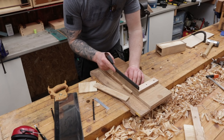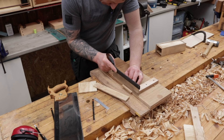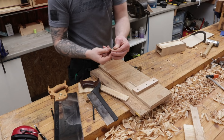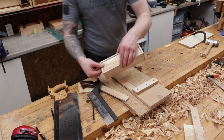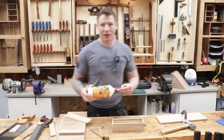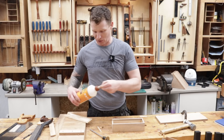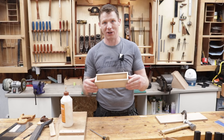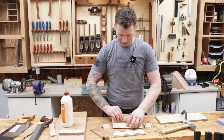We're going to cut the top of the box off using the edge of the rebate as a guide to get a nice clean straight cut. Then we take that piece and glue it onto our lid so it looks like the box is closed. The next job is to get the box all glued up. When that's set up we can fit the lid. We need to make sure we don't glue our base into the box — we want it free floating inside that rebate to allow for expansion. Just some glue on the miters and we get this clamped up, taking care not to get too much glue into the rebate.